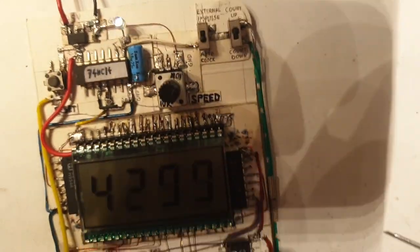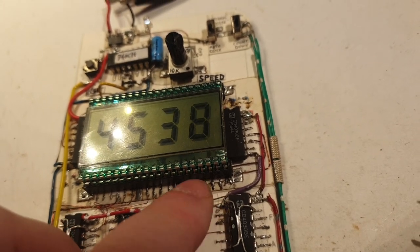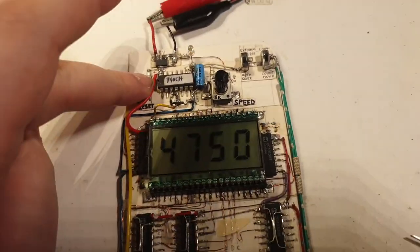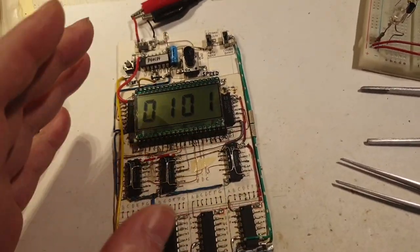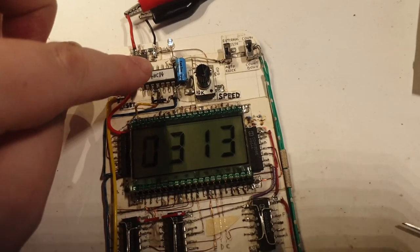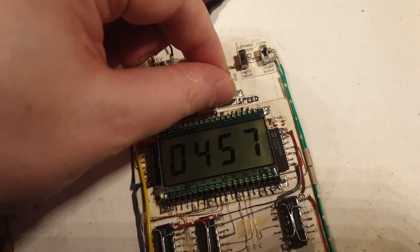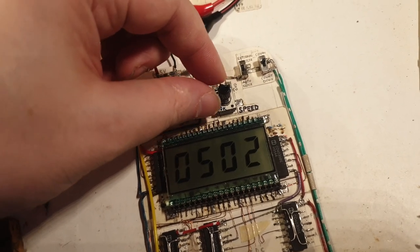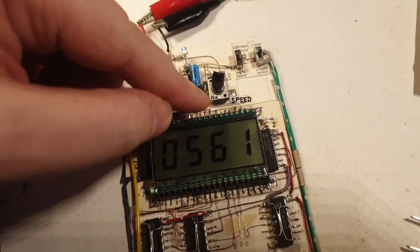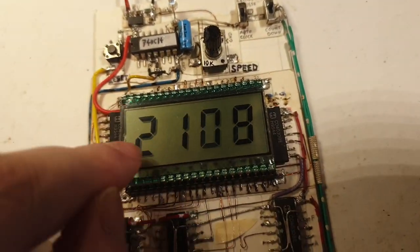The pins are very dry — they don't wet easily and don't catch solder well, probably because this pin support is quite old and not well made. Problem solved! With this last error fixed, at this point I've finished the project. I only need to add a few add-ons: a one-second switch using another gate from that chip to beat exactly one second, and I can also fine-tune it with this potentiometer. I may change the capacitor slightly to get exactly one second. I really like the fast speed option when turned to maximum.